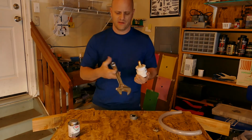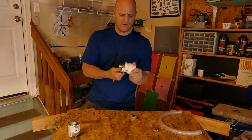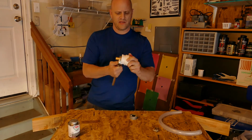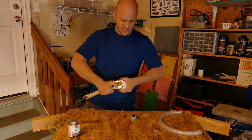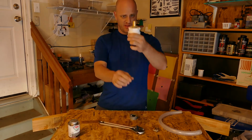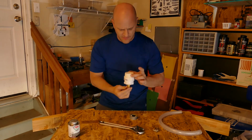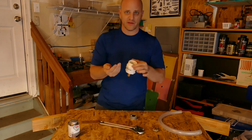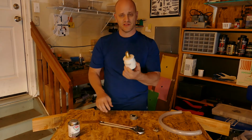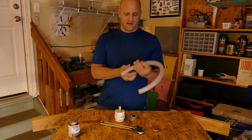As soon as it gets hand tight, tighten that down. That's pretty dang tight right now. It's level on both sides. It's screwed in straight. Everything looks good. There's nothing coming out like where the brass fitting goes inside the PVC. There's no tape coming through or anything like that, so I have no reason to believe that's not a good fit. So the majority of it's done here.